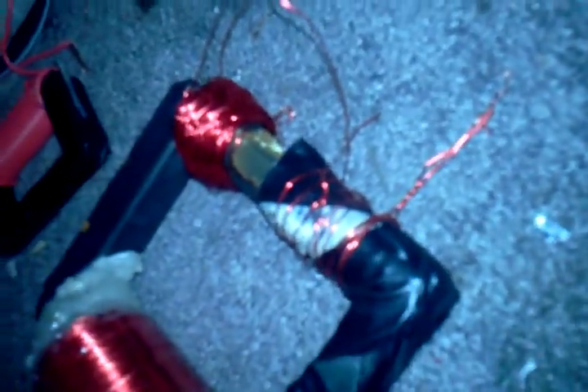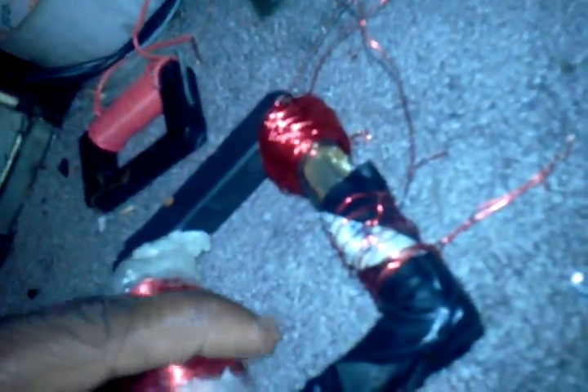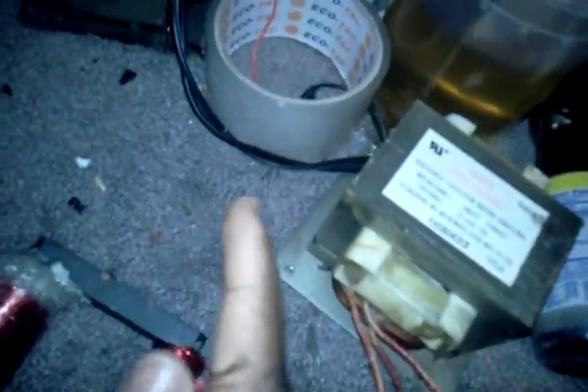There's always the drawback of corona starting between the primary and secondary coil, but I just actually like these big U-cores because of the option to make a big secondary. I might, once I get around to it, make a little secondary across here. I really don't have anything better to do with this core. At first I was using it for a ZVS driver — just inductance. I used to have a center-tap 10-turn winding right here and power it directly. But the ZVS driver doesn't work anymore, so I might make a small secondary right here.